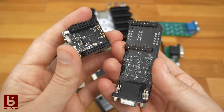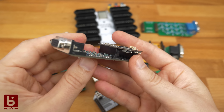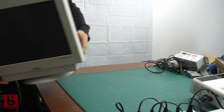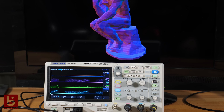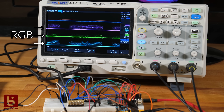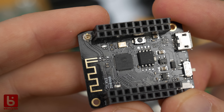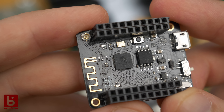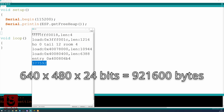One of those was a simple extension board for a microcontroller to connect to a VGA display. VGA — you know those chunky connectors from the previous century on those antique screens? It basically uses three analog voltage levels for the RGB pixels and two sync signals to indicate a new frame and line. The limiting factors of the microcontroller are the bitrate we can output and the RAM. After booting, there are basically around 300 KB of memory free, which doesn't even fit a VGA frame in true color.